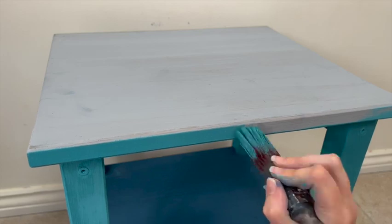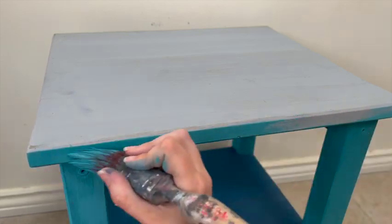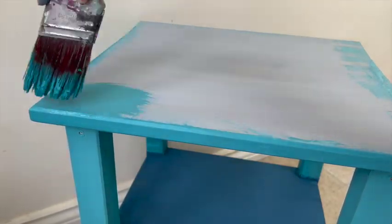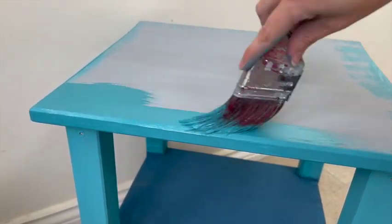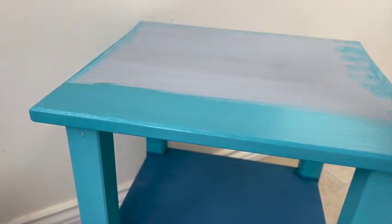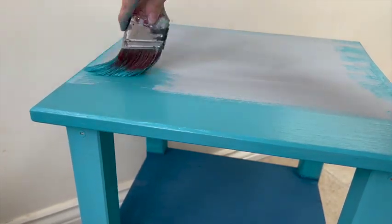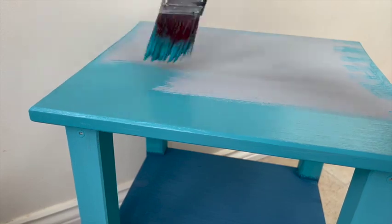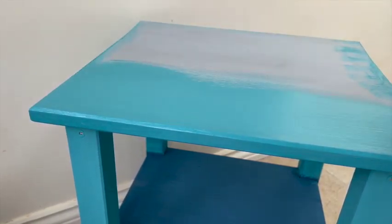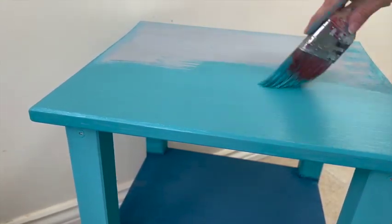Because the clay paint reactivates with water, you always need to seal it with something that is not water-based — something like a wax. Unlike the normal paints I use which tend to be self-leveling and hide brushstrokes, clay paint doesn't do this. All of the brushstrokes and texture that are naturally visible will be there, and you have to make it a feature — which is why it's artistic, giving depth and texture that's more interesting than a flat finish.